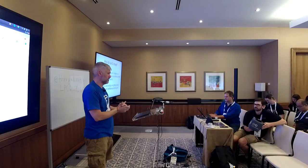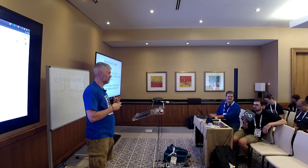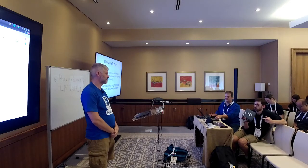And was that recent, like, when did that happen? Within the last year. But one of the issues with that was that there's no pull-up support in libgpiod, so the new interface doesn't have pull-up support, so that was kind of one of the downsides. And I know there was some discussion about whether that should be in GPIO or pin control, and then it got into, like, the weeds.